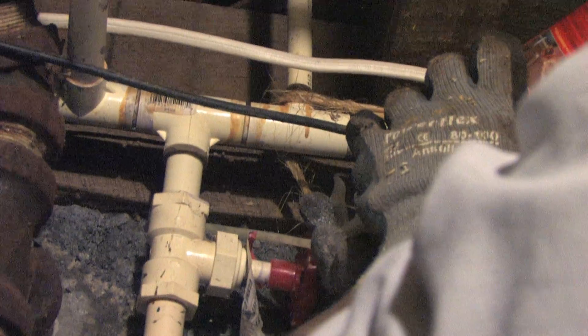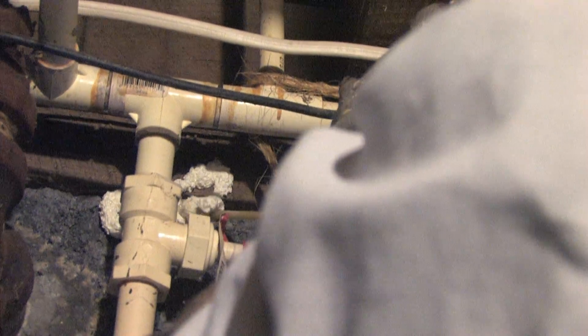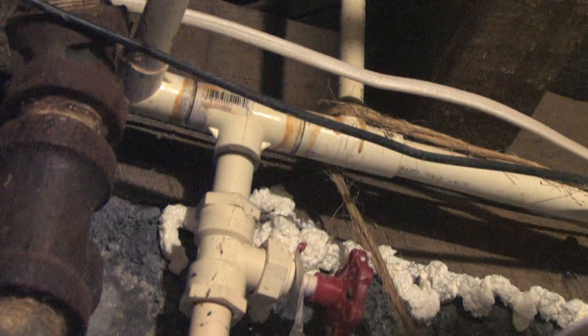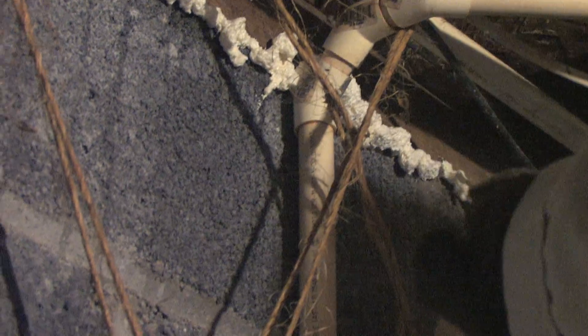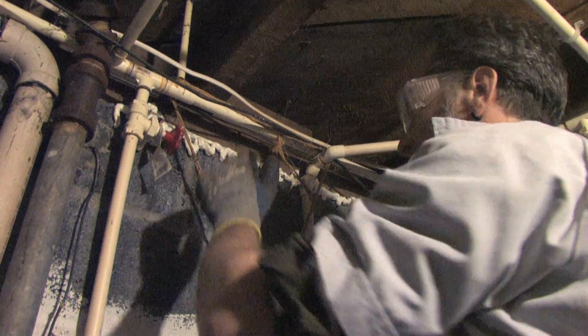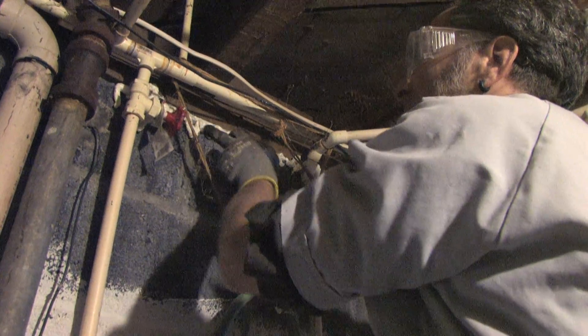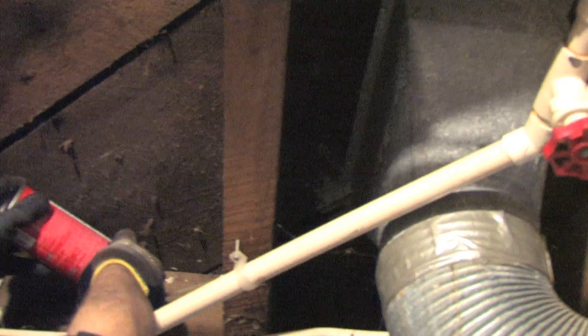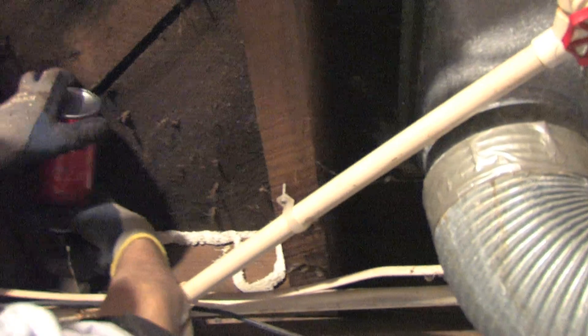I open it and press it as gently as possible. This stuff can be messy. Afterwards, if you want, you can take a knife and cut this all off — it becomes very easy to cut once it's dry, but right now it's super sticky. I would do this all along the whole edge of the basement, the whole edge of the whole house. So now I'm sealing all four edges of all the sill and band joists.